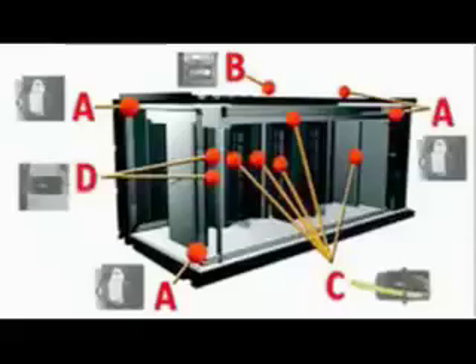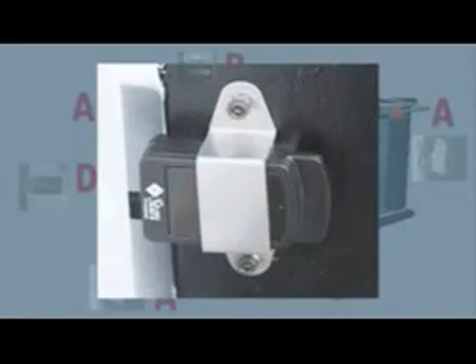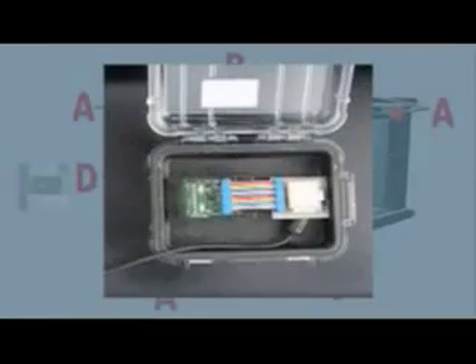As a group, we went and talked to some of the black box members and found out what kind of information they wanted about the box as it was traveling, what the requirements were, and we assembled some sensors for the Sunspots, including humidity and temperature sensors. We used the onboard 3D accelerometer to measure some vibration data, and then we attached a GPS and, finally, a cellular modem so that we could get real-time telemetry back from the box as it was traveling.